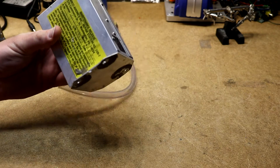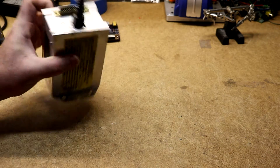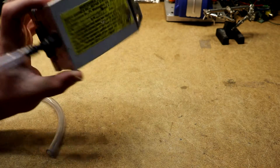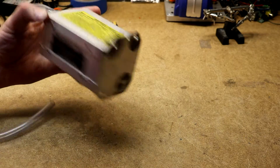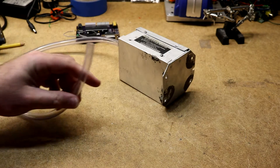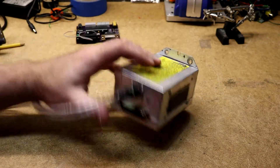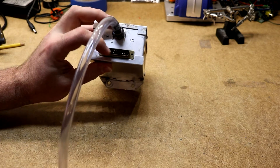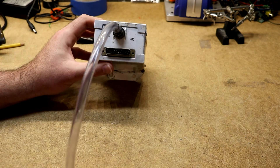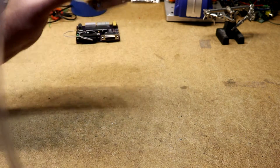There's a variety of these things from very old ones to very new ones. This is sort of a middle-of-the-road one, last released from maintenance in 1990. What these things do is they also have a tube that hooks up to outside air, measure the air pressure, and on the back they send out a signal that tells your transponder how high you are. Your transponder then tells air traffic control, so they can alert other planes — for example, that there's a plane at 10,000 feet.